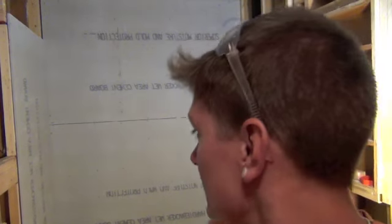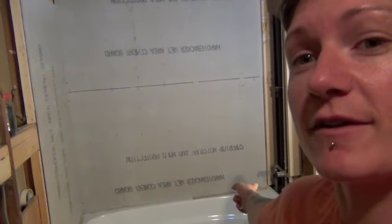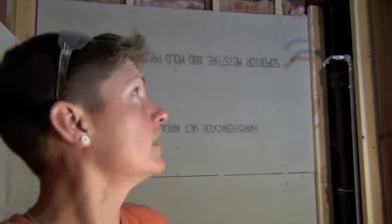Okay. Day 2 of the bathroom remodel, and got the tub in. Uncle Dan really helped out because we had to, you can see those guys, we had to shim out the wall in the back a couple inches. The left side was alright, we just had to notch out a little bit on the top of the tub here so it scooted back and didn't rest against the plumbing on the right side, which we did not have to change out. I'm gonna raise that up a bit and have it come out some green board up top.